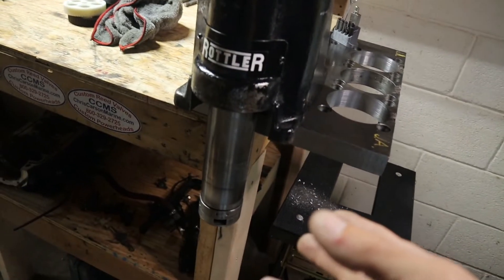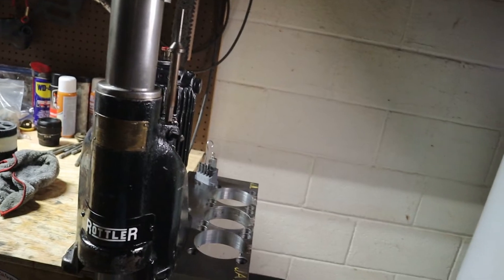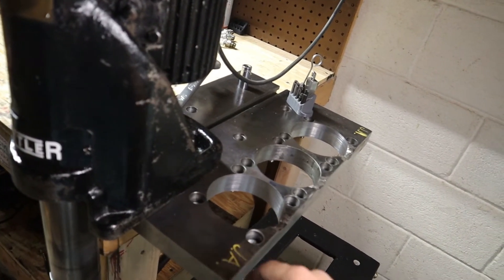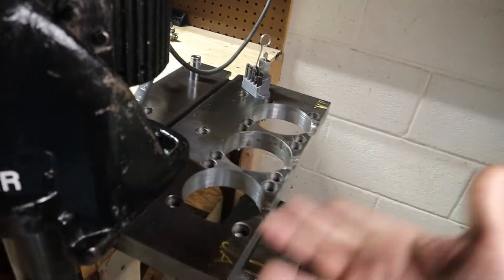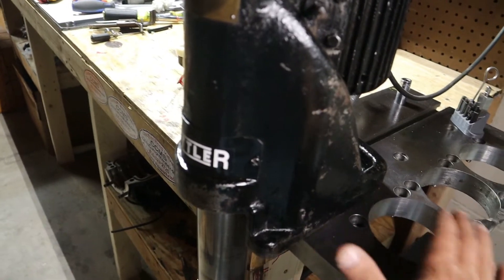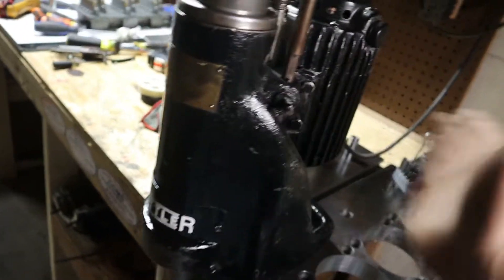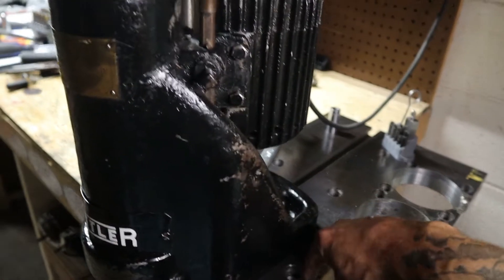I'm not really trying to teach you how to use the bar — I'm just going to show you how I use it. This right here is a specific plate that I designed and a buddy of mine cut for me, just for a 2.5-liter Mercury. The block actually bolts up from underneath — think of it as the head torque plate. You bolt the block up to this plate and then you have a true parallel surface to the deck to float your boring bar on, which slides on a T-nut across the T-slot. It can really be maneuvered anywhere on the plate, any angle, to meet any hole inside this 4-inch cut.